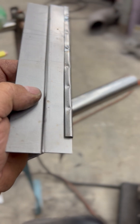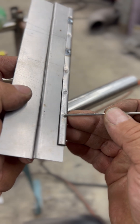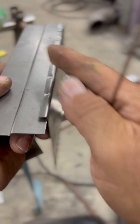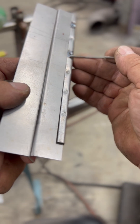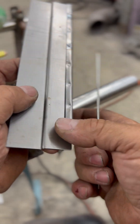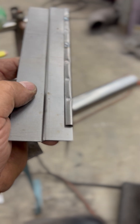This is a flange seam that we have to do. This is a sample that we're practicing with. This piece here has had a quarter inch flange turned in it, and then it's set down on top of the end of a piece of board. We use the eighth inch punch to punch that into the board just to make a slight depression, which makes sure that when we go to clamp this, these two are contacting where we want them.